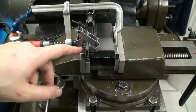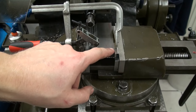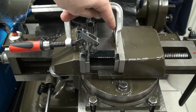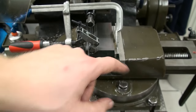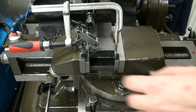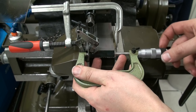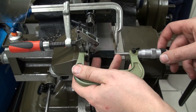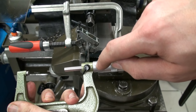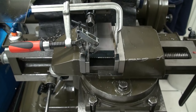Okay, you saw me take the second cut, and let's take a final measurement. I secured the second gauge block with a big Bessey clamp here because the measurement was not very reliable. And yes, I put some brass shim between the clamp and the gauge block. So it should read now 50 plus 3. So take a measurement. Maybe 5 thousandths of a millimeter. So that's perfectly fine.